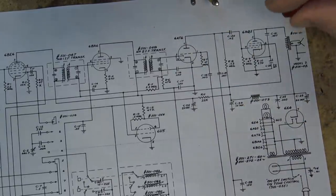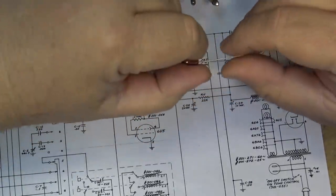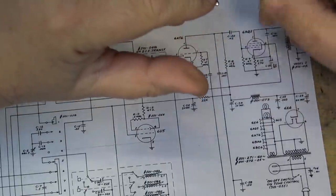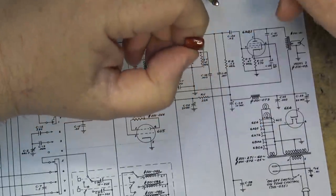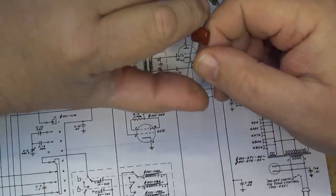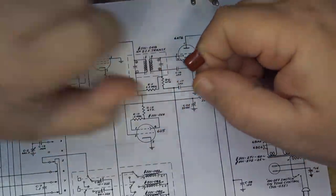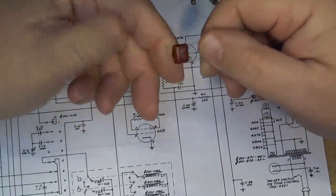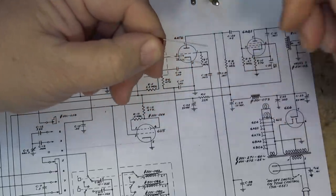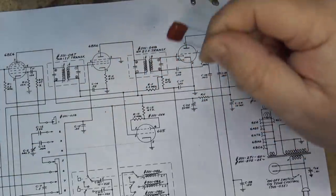And say the older parts, the older, larger capacitors, they will show a much higher noise floor on them when you're looking at them on the scope for your outside foil and your inside foil. These new ones here are much more difficult to actually determine which is the outside foil, because the surface area is much smaller. You can do it. You just hold it in your hand and let your body act to induce the signal into them, and you'll see a level difference between one polarity and the other. But it's not as big a deal.